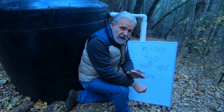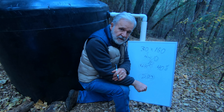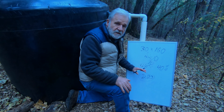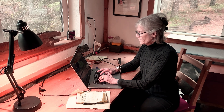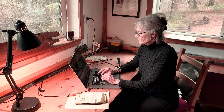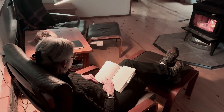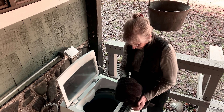That's your magic number — 280 watts. If you can stand to get 280 watts every hour, 24 hours a day, 365 days a year, and that's enough to manage your system, then you're good to go. That translates to about 10 amps of power 24/7. That's enough to run our laptops, read late at night, run our washing machine, and still keep our batteries charged.